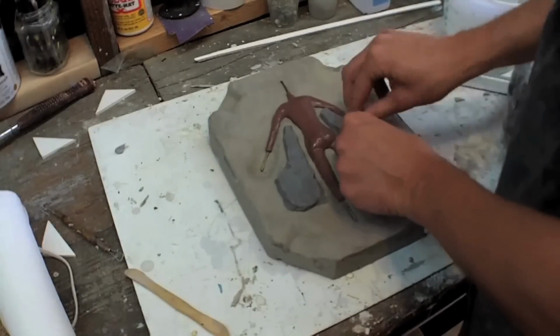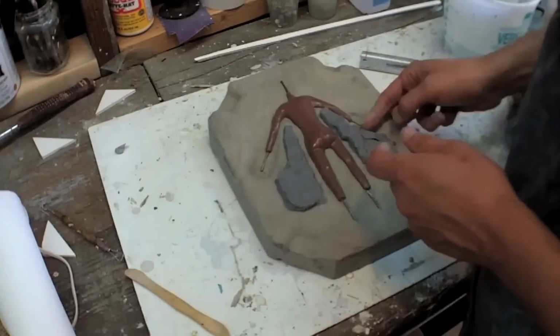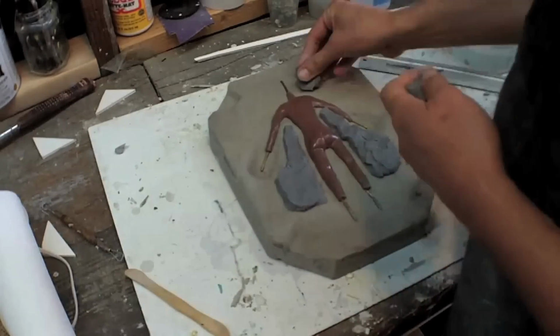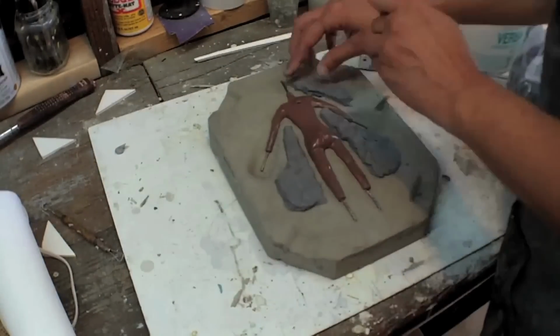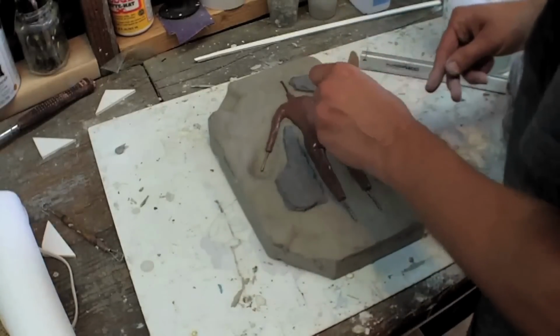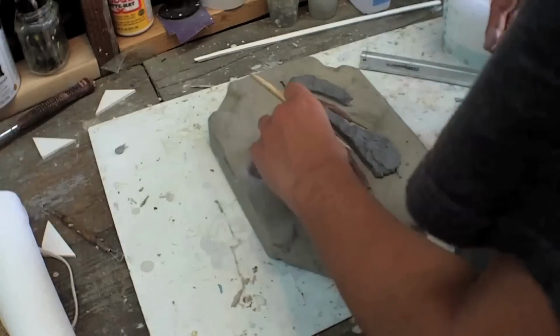an open air chamber. And in that chamber, when you put your two halves together, the excess silicone, the extra silicone that's not going to be used for the puppet, because you're going to have excess when you make this, is going to go into these chambers and allow the mold to actually fit really tightly together. Otherwise, if it was coming out the sides, the mold will never actually sit properly, flush against itself.